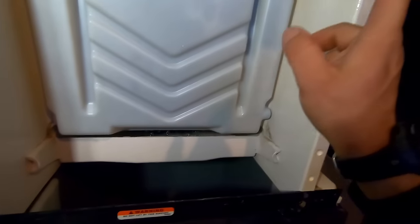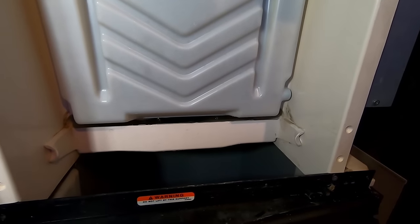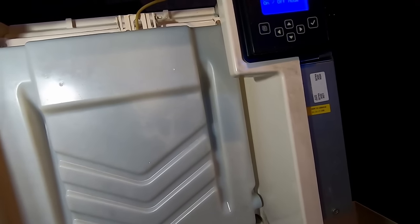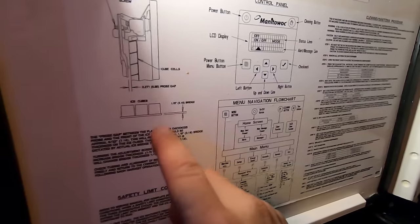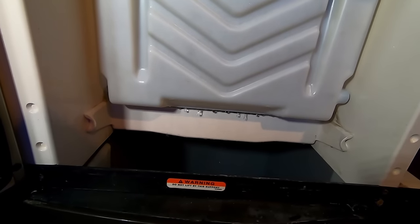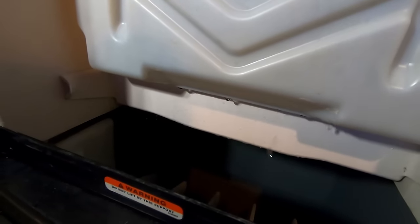It took 18 minutes to go into harvest — I had to adjust my 5/16 adjustment. We just went into harvest so I'm starting to time that. You can always go back to default on the gap, which is 0.21 inches. I'll use an allen wrench closest to that size and put it between the metal and the bottom of the plate — the ice thickness sensor — and adjust off of that. Looks like we're getting ready to drop already at 58 seconds, so we're probably fine on refrigerant charge. I don't like the way it's coming off that bar and not dropping — that's probably all that calcium buildup on the lip holding it, which is unfortunately going to cause the ice to melt.